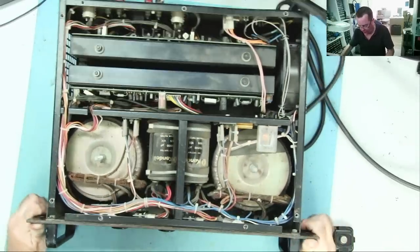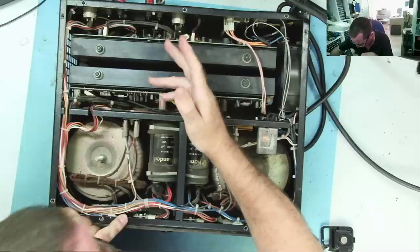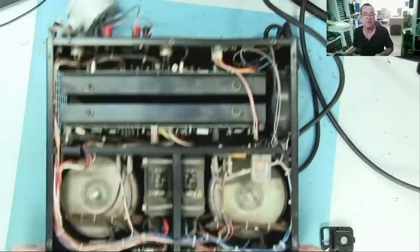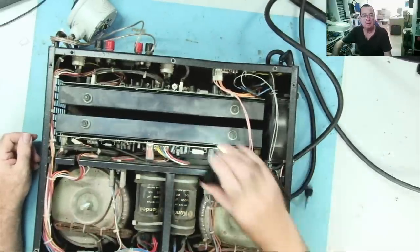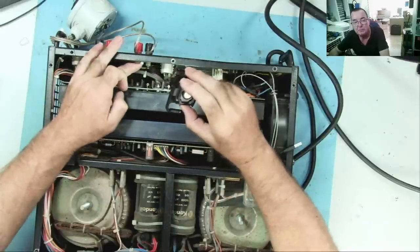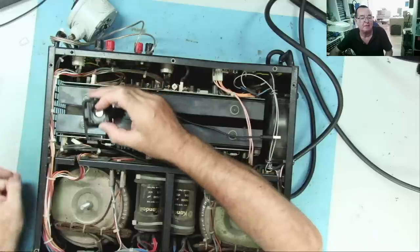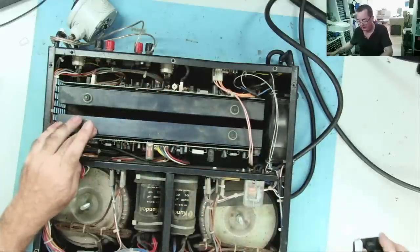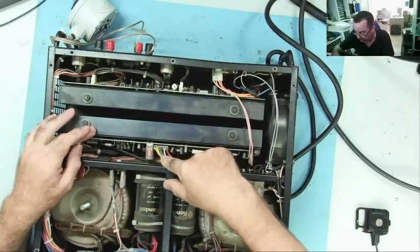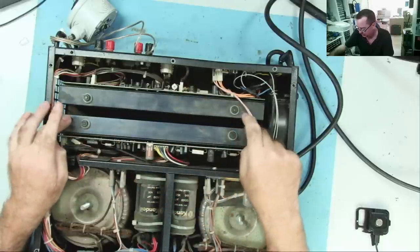This is marked channel one on this side. I could either disconnect one of these and power it up, or maybe I can just get on with the meter. Another way would be to look at the speaker connectors down here and see where they go to. It looks like these speaker connectors — which is channel two — go to this board, and this one which is channel one goes down to this board. From what I can see, this is the actual speaker output on this one.